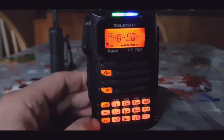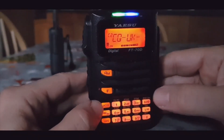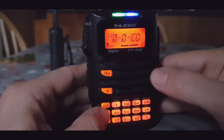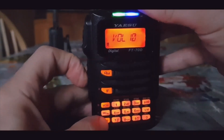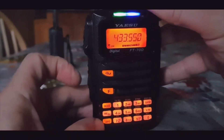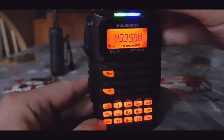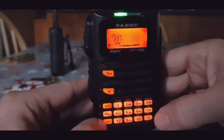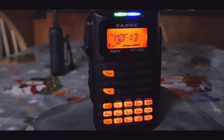To disconnect, hold down the Band key - it won't let you disconnect until they've stopped speaking - but that's how you disconnect. To go back to your normal screen, hold down the Mode button. The hotspot stays connected on that frequency so you can still hear it, but you're back to your normal VFO or memories. It's a nifty little radio and works so well with the hotspot - great value. Please subscribe to this channel. 73.